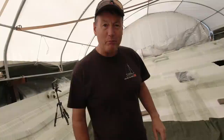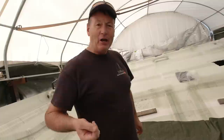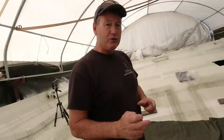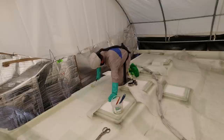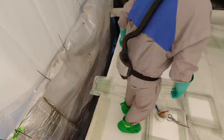Two layers down up the front. I've sanded the entire area to prep it and now I'll lay down one layer of 600 double bias, another layer of 300 CSM, and then I'm ready for foam. My plan is to finish each section to reduce prep — get the foam down, reset the chemistry, then lay the final two layers of glass on the foam. I do have a foam shortage at the moment and am waiting on stock, probably not until next week.